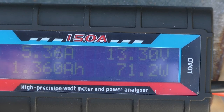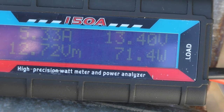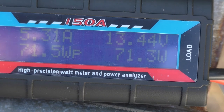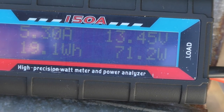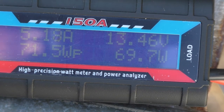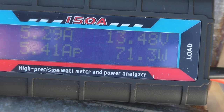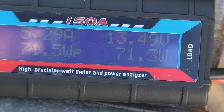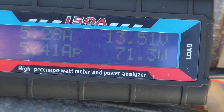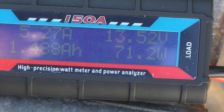That's exactly the result I would have expected considering the difference in price between these two units. There is no doubt in my mind that the eBay MPPT is a badge-engineered fake. I suspect it won't have a long life because of the lack of heat sinks and the ability of moisture to get in where the wires go through — but we're going to give it a good test and let you know in a later video after using it for some time. Right up front though, if you want the maximum number of amps from your solar panel, an MPPT controller is obviously the way to go. They are a little bit more expensive but the price has really come down — for under a hundred dollars you can get yourself a really good regulator.